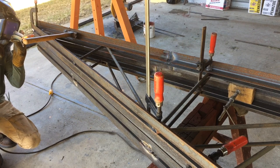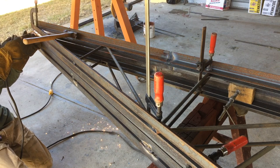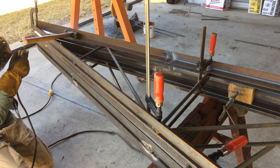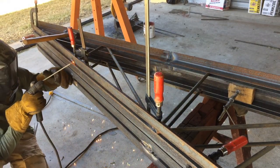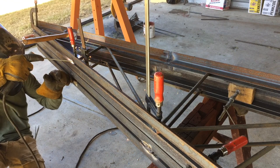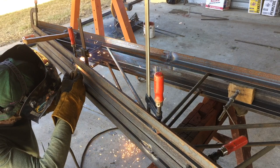One of the advantages of this truss design is you're able to get a lot of welds in between the bars, and that gives you a lot of surface area where you can weld. I'm welding a bit on the top and bottom on both sides of each bar, as well as the ends and on the tops on the outside where you can see it. And then the truss gets flipped over here in just a second